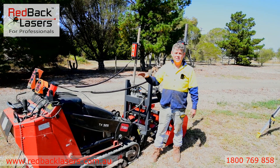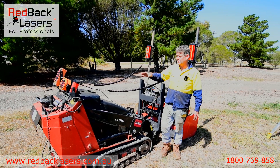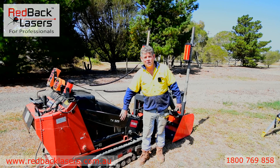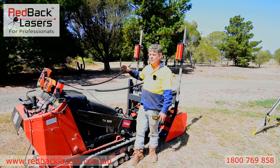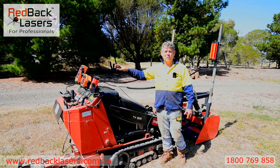If we're running this in a skid steer or trailing behind a tractor and we're wanting to take it on and off quite easily, we'll add a breakout box for the electronics and put that on your arm or somewhere at the three-point linkage on your tractor. We'll run all our electronics to a breakout box and then from your breakout box through to your in-cab controller.